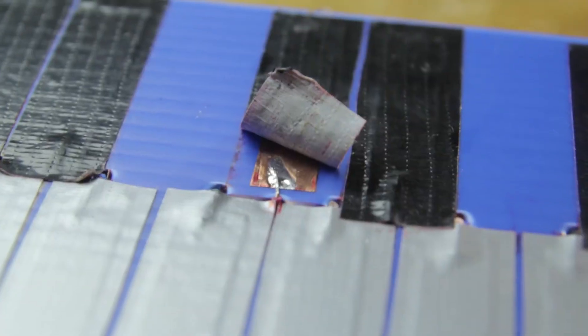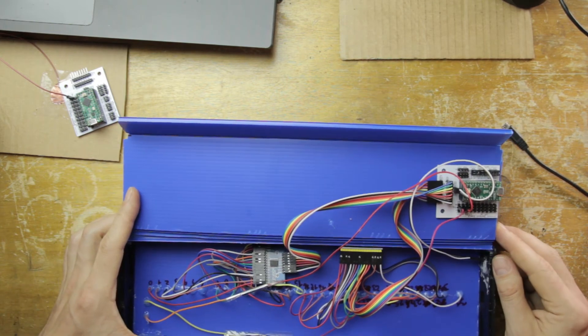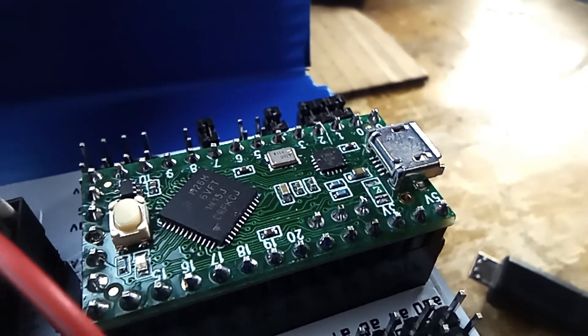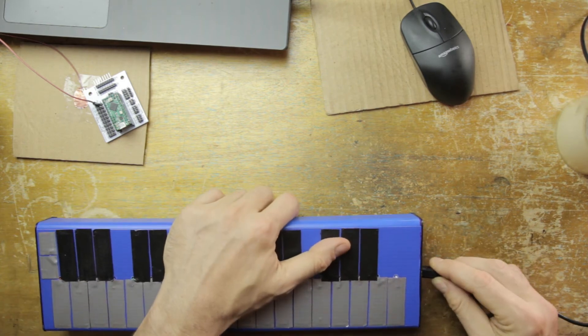The other important factor is what's called parasitic capacitance — a really cool name for all of the unwanted capacitance that we end up measuring with our sensor setup. When reading any one of these keys, the DIY sensor itself is really just a bit of copper tape — no different from the cable used to connect it — so we're actually also measuring that cable. It doesn't stop there: this sensor connects through a multiplexer, so we also include the trace on the multiplexer, the cable connecting the multiplexer to the microcontroller, and even the trace on the Teensy itself carrying the signal to the chip. All of this is constantly responding to changes in the electrical field — that's parasitic capacitance.